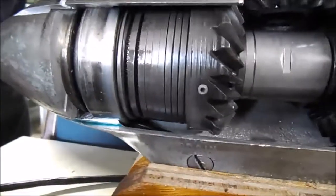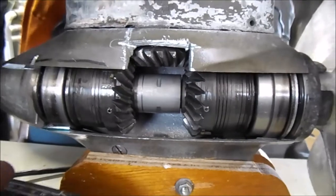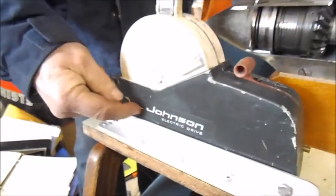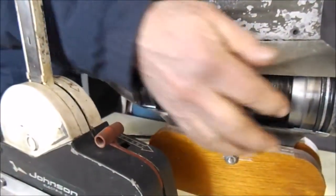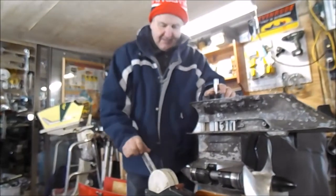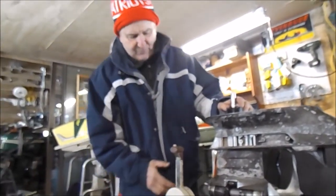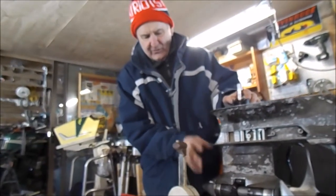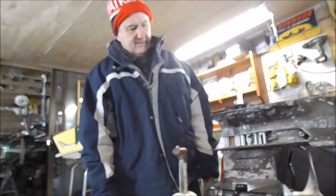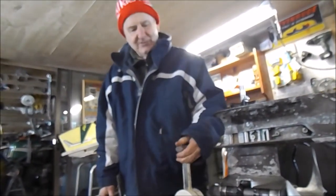Let's see that again — forward gear spinning forward. This works with a switch that puts electricity to one of these two solenoids or coils of wire. There's an activator or roller that pushes a switch one way or the other. The hydroelectric had a switch that looked exactly the same and would activate the solenoids to go into neutral and reverse, while this one makes it go into forward and reverse and doesn't have any power in neutral. Maybe we'll have another tech series on the hydraulic lower unit in a few months. Thank you very much.